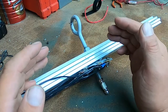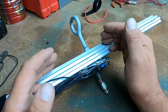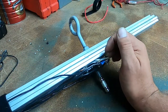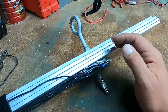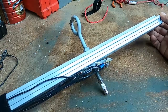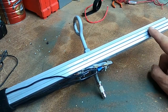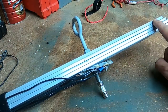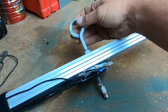This particular antenna is what I built specifically for my software-defined radio dongle so that I could pick up local FM radio traffic. Essentially it's four pieces of aluminum stick, just drill a hole right in the middle — these are about 19 inches long — and just put an eye bolt through that.